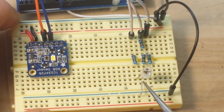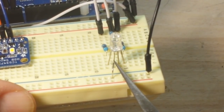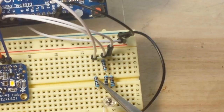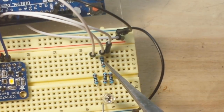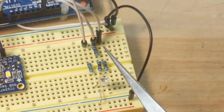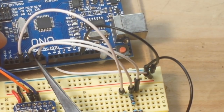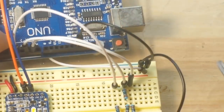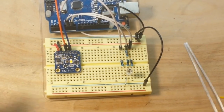This is a common cathode — most of them are common cathode. You can see this is our red pin, that's our common ground, green and blue. You want to put resistors on these pins. I'm using 1K resistors so these aren't too bright. Because I don't have a 2K resistor on the green, I'm using two 1K resistors — the green is the brightest color, you don't want it to overpower everything. Red goes to pin 3, green goes to pin 5, and blue goes to pin 6. Those are PWM pins — you can see the squiggles there — because we need to output analog values to them. And that's really all there is to the hardware setup.